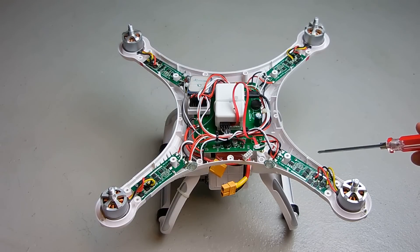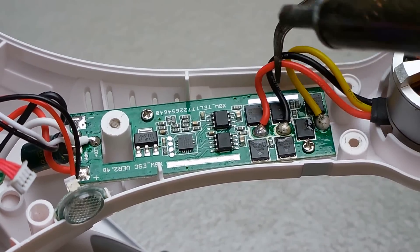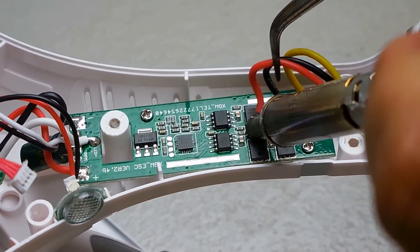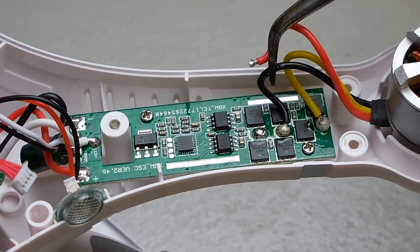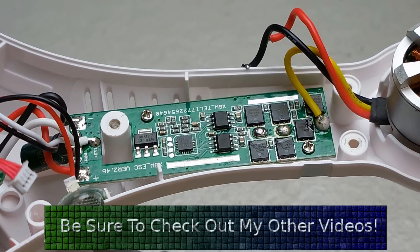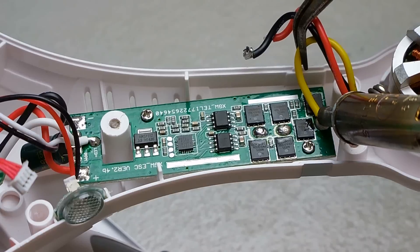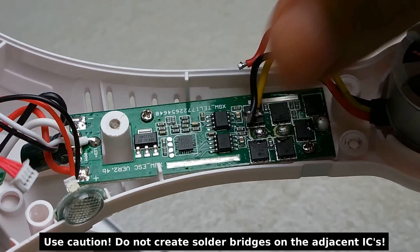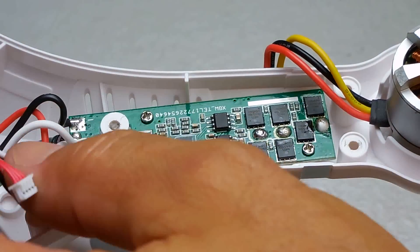Take a picture using a digital camera or your smartphone so you know exactly where the wires go and don't confuse anything. Once it's all put back together, you can try it and the problem should be gone. Let me swap this one out and show you — I'll desolder the wires. Just remember where they go. I'm soldering with my left hand, which I normally don't do.